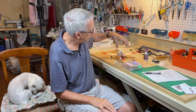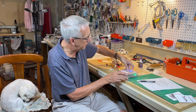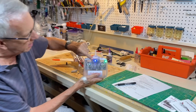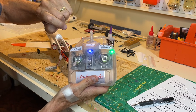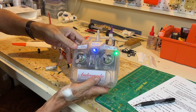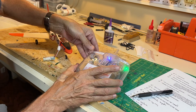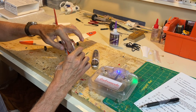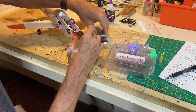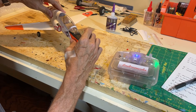To power up the model per the directions, you plug in the battery to the ESC first, then turn on the transmitter. You've got a steady blue light, so it's connected and bonded. Green is the auto-leveling mode, so we're good. Be sure to keep your throttle low when you turn it on. This is the two-cell battery — put it as far forward as possible and use a little tape to hold it. You can hear a little chattering, which is the stabilization system working.